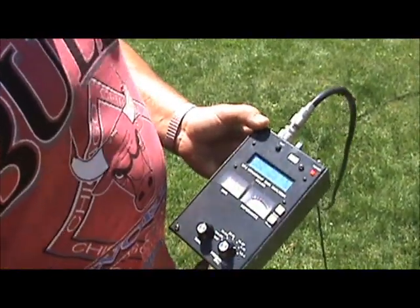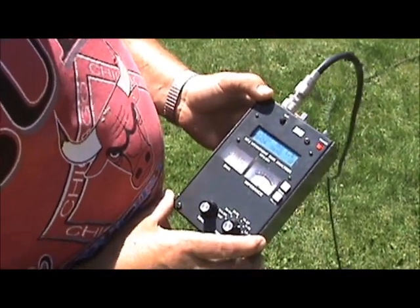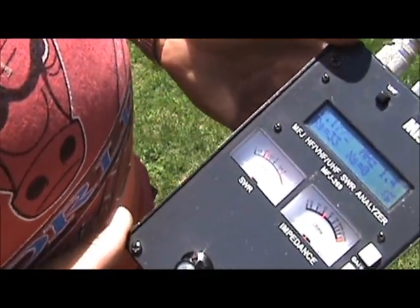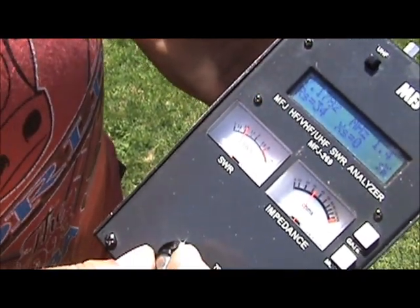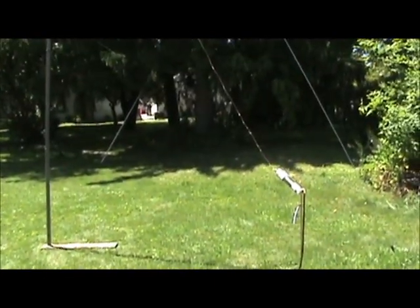That's the antenna with this length of wire, and you can see we have the wire strung up in our pretend tree. We can set this for 40, 30, 60, and 80 meters. Right now you can see we're set at 40 meters — 1.4 SWR at about 7.176. She's pretty flat throughout most of the band; at 7.260 it's at 1.5.